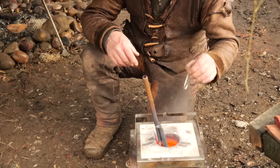So I made a copper punch before, and I would be using that, but I've lost it. But it was very, very mildly soft, because it was absolutely 100% pure copper, which they may have used, or they may have adulterated it a little bit. So that's been adulterated just a little bit. Not by weight or measure, just by guesswork. I reckon I put about 2%, maybe 3 or 4% tin in it at max.